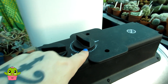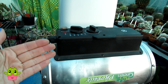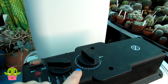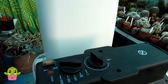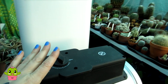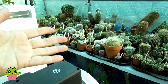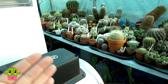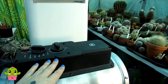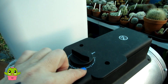The heater has a thermostat sensor you can set to stop the temperature dropping below a certain level. We have ours set at number two — it doesn't display Celsius directly, so you have to play around with it to find the right setting. At number two, when the heater is on it keeps it around five Celsius minimum, then rises to about seven Celsius before cutting off. When it drops back to just below five, the heater kicks back on, so it never drops below five.